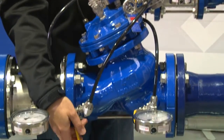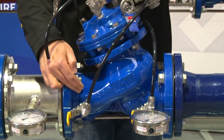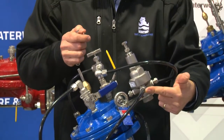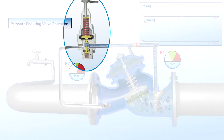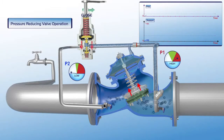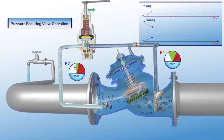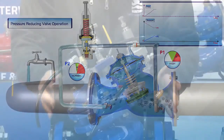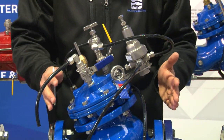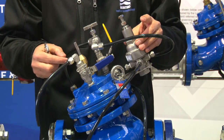When I open the outlet ball valve, I'm now exposing the downstream side of the valve to the underside of the pilot. When I apply tension to the top of the spring, the passage in the pilot opens and allows water to run to the downstream side of the valve. This is how we prepare the valve for first operation. It's very important when first starting that the valve is drip tight closed and all air has been removed from the chamber.